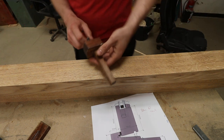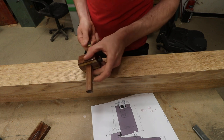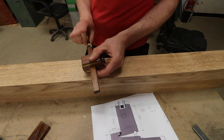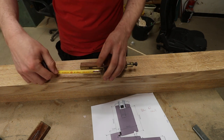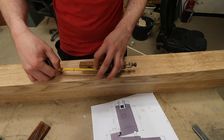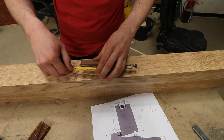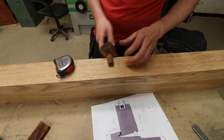So with this type of mortise gauge, you can wind the second pin to suit the chisel on the mortiser, so that the centre points are exactly the outside dimension of the mortise chisel, or 16mm, whichever way you prefer. Not a bad guess. Then we can set it to suit them lines.